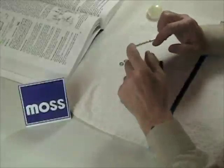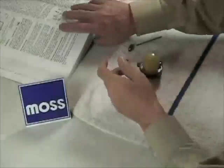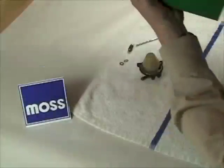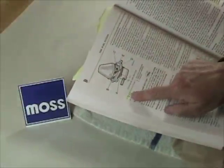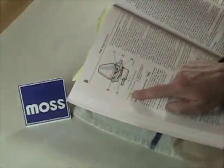Let's talk about how to set the float level in this carburetor. I've got the Bentley manual here for the early MGBs and I'm on page 134. You can't see it because the type is small, but it says here the float level is set to 1 eighth to 3 sixteenths of an inch.